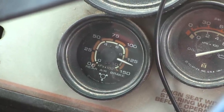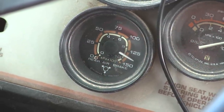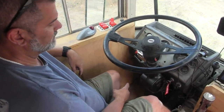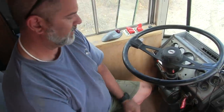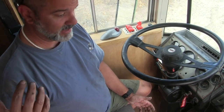Nothing's happening. It just did it. It worked. That's it. Okay, this part is working. So we're there. Okay, that was the problem. We had a faulty part. Now we got a good one. Yes. So at about 130 pounds, if this is accurate, or 135 PSI, it then activated the cutoff.